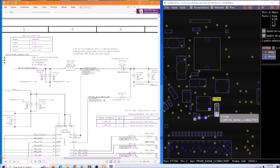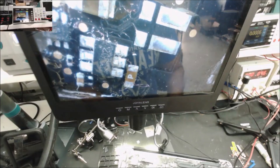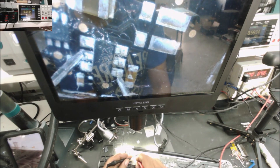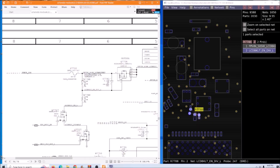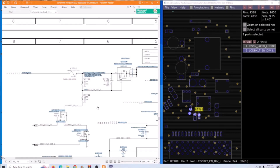So this is our fuse. Number one is the nine-volt input and number two is the output going to this resistor here, then from this resistor to this resistor. The battery is already disconnected. We go to diode mode - the fuse is good. These pins here, one of them is the gate, one of them is the source. Let's go to resistance mode for these two resistors: one is 300 kilo-ohm, one is 147 kilo-ohm. So both resistors are good.